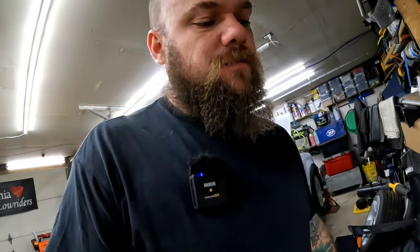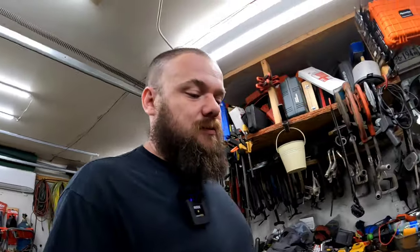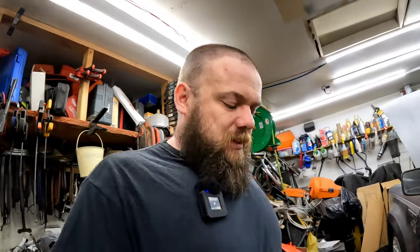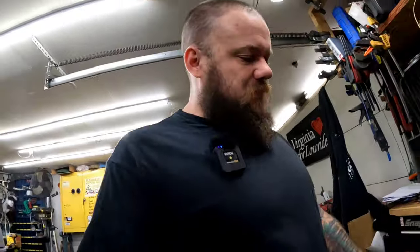Not sure where we're going with this. I've made a lot of exhaust over the years, but with normal regular steel exhaust, if you've ever messed with it you'll understand — regular exhaust doesn't really care; you can hit it with a MIG welder and a little gap is fine. Stainless steel, it's got to be tight. There's a little more precision that has to be done in order for this not to look like complete crap. We just need to get straight to work — I keep pacing back and forth and I've got to stop it.